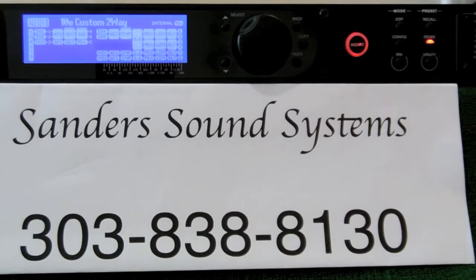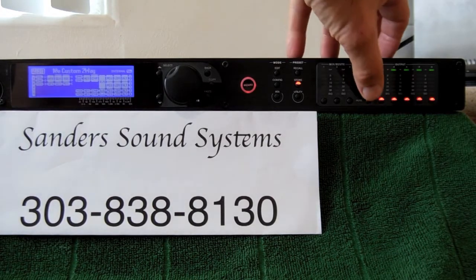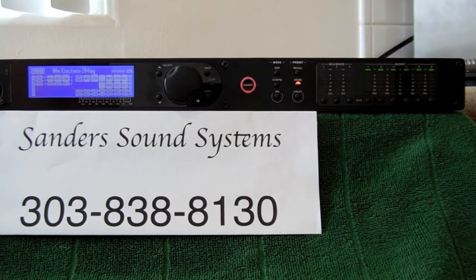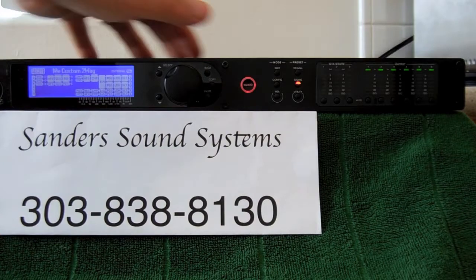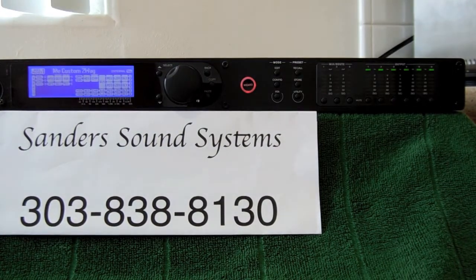When you are finished reconfiguring the unit, you will find that it has automatically muted all the inputs and outputs. Unmute them by pressing all the red lighted buttons. Finally, you will see that the store button is still lit. Press it three times to store it. Your loudspeaker management system is now properly programmed for digital input. You are ready to play.